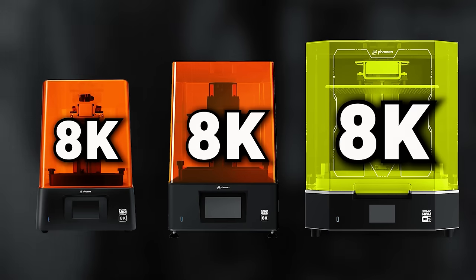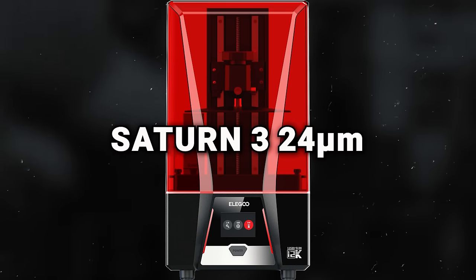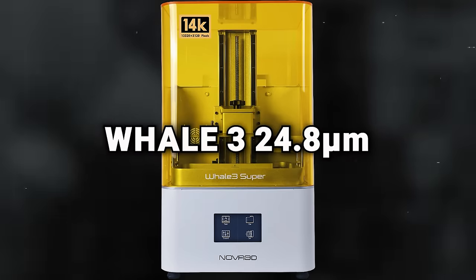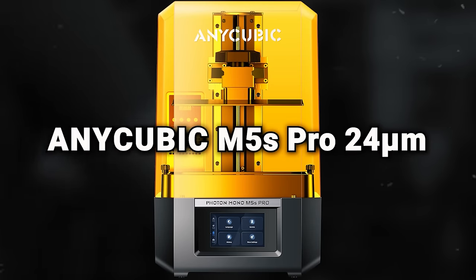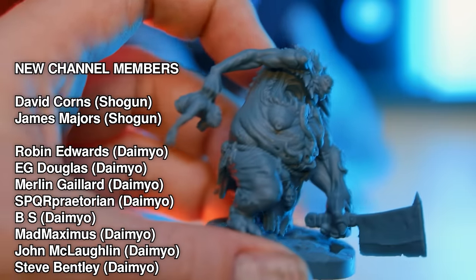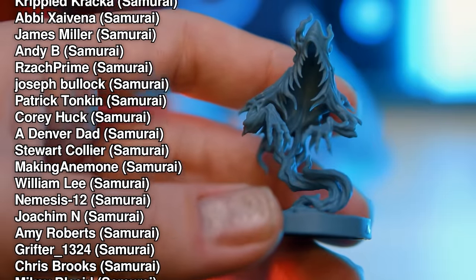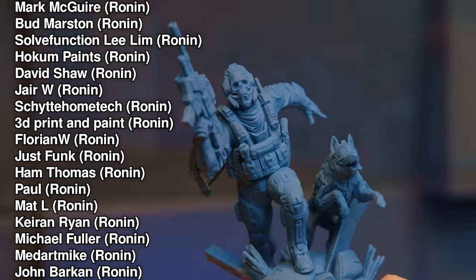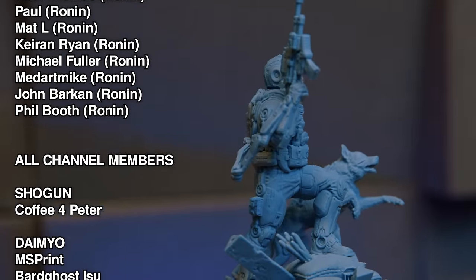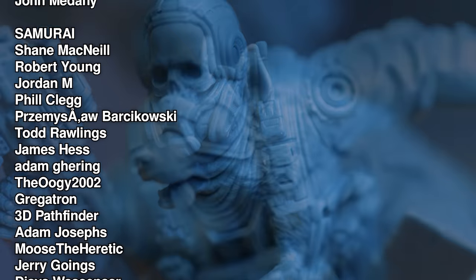That's my rant over, and I hope everyone understands why 12k is irrelevant now — it means nothing without knowing the screen size of a printer, and even then it's a lie because of irregular pixels. With AVC, we now have a way to compare printers as a baseline, and I sure hope this is adopted going forwards. It's certainly the metric I'll be using in my videos as a rebellion against the measurement of K. Thank you for watching — if you got to the end, well done, because a lot of that was boring tech talk, but hopefully it helps people. Thanks to our members whose support really helps fund these videos, and it's your comments and feedback that keep me going — there is nothing better than hearing I've helped you in some way.